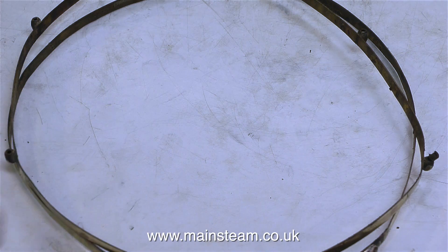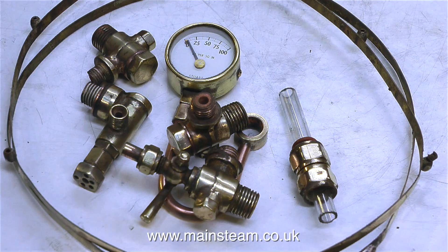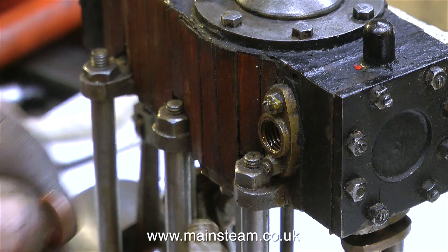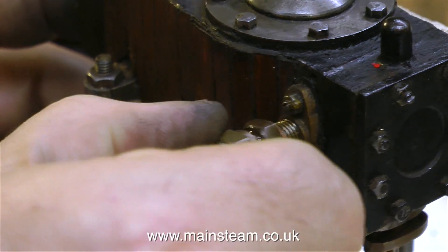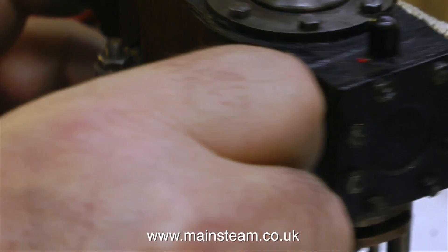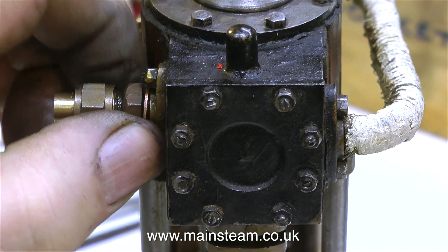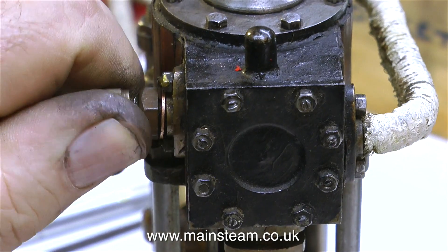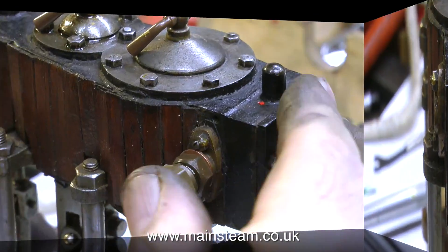Here are all the clean parts: the boiler bands, followed by the pressure gauge and siphon, and all the other bits. And now back over to the engine — this is the exhaust side of things, and again it's not very good, it leaks. But this is a quick fix — nothing that a bit of 542 and a couple of washers won't put right. The thread on the pipe fitting is just a little bit too long for the flange that mounts onto the cylinder, so just another washer stopped it from leaking.